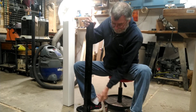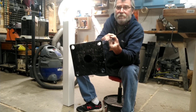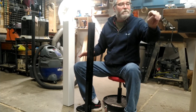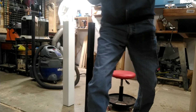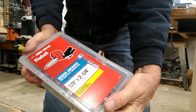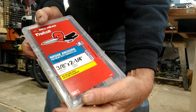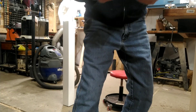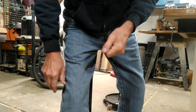On the bottom of your post you can see your four holes, so we're gonna use a three-eighths concrete drill for that. Then I'm going to put these three-eighths redhead anchors in. There's all kinds of different anchors you can use, but I prefer these. You drill a hole and pop them in there.